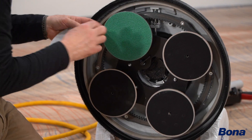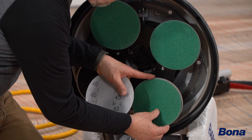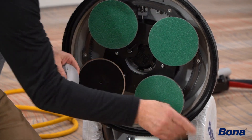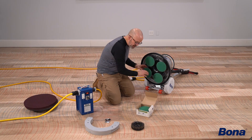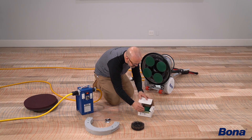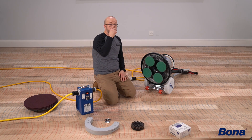I've got a quarter inch intermediate pad and then 40 grit green, which is one of our ceramic hybrid products, and I'm starting out with green because I want to be more aggressive on my first cut. Some guys will stay with green throughout, but there are options down the road that we can talk about as far as our abrasives.